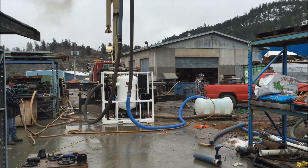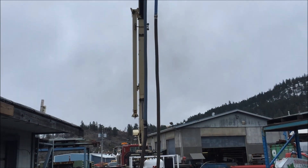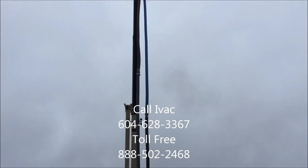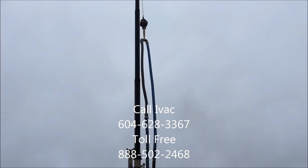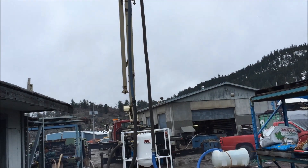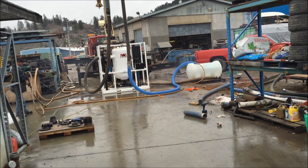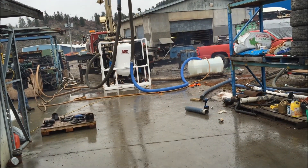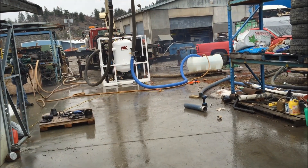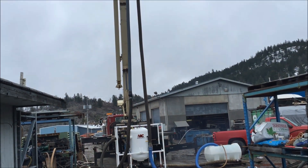As you know, a perfect vacuum or pump is only able to lift 28 feet. Unfortunately, that is dictated by physics and no amount of horsepower will let you exceed that. Well, we know that under certain circumstances we get ourselves into areas where this needs to be higher, and how to do that is with an IVAC PB500 vacuum delivery unit and our suction assistant.